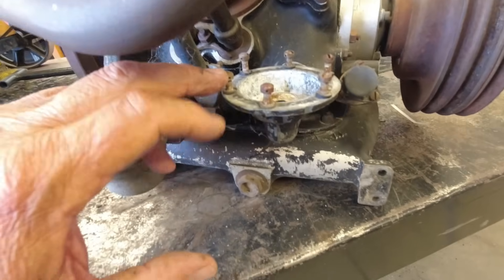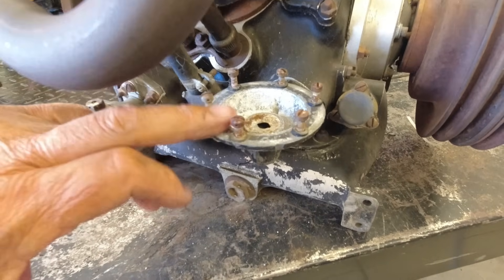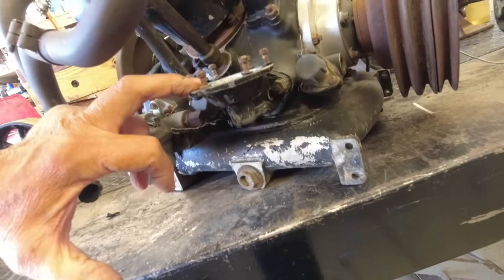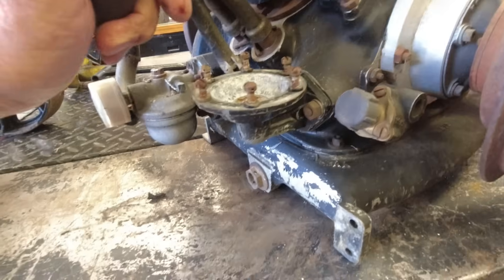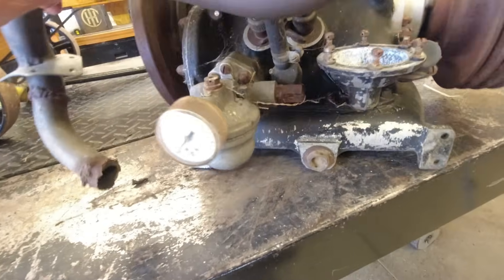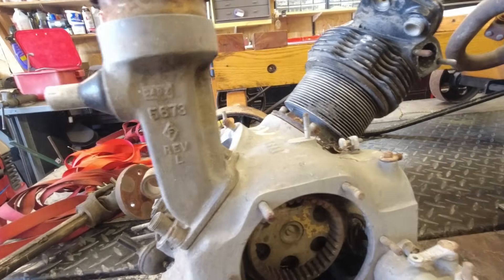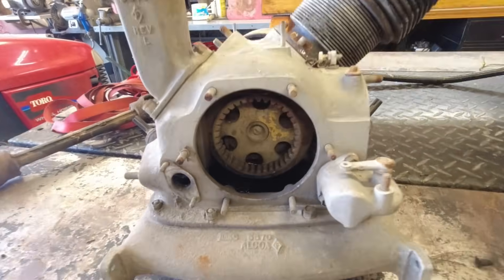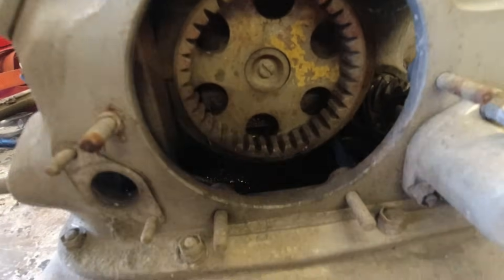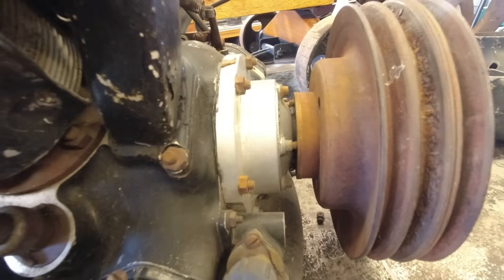This was a fuel pump but it was junk — the fuel had gone old and nasty, so I rigged up a gravity feed system. I've been told a Willys Jeep fuel pump may work on this. Here's a tach drive for a tachometer if they wanted one. Over here is the spare engine block showing how the accessory was driven — a piece bolted on here engaged these teeth, and as that rotated it drove the accessory. He did a really cool job making that work. Here's the oil pump and strainer; I believe that's a little strainer screen in there. Everything is safety wired so it can't come apart.